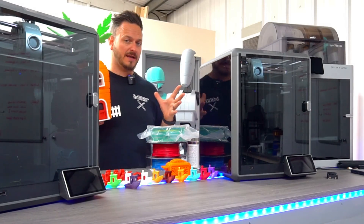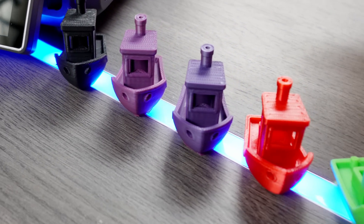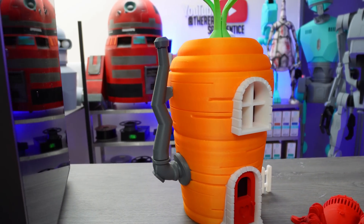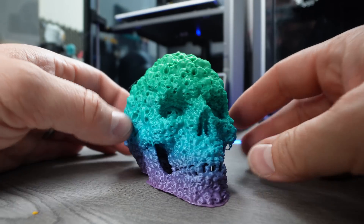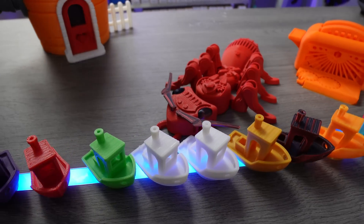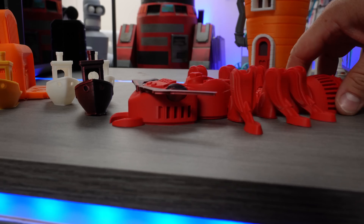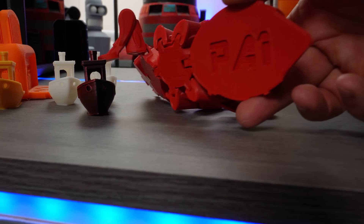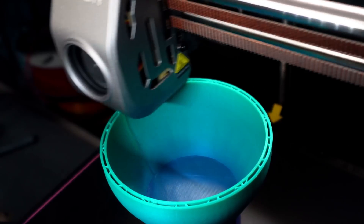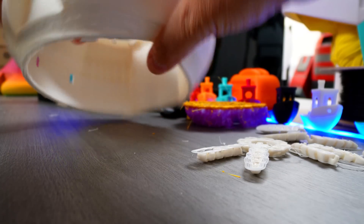So what are the quality of the prints actually like? The K1 has truly exceeded expectations in its flawless printing performance, ever since the parts were changed and the firmware was upgraded. The overall quality of prints and ease of print removal has been exactly as anticipated. The printer has proven its versatility by successfully printing various materials including PLA, PETG, and ABS, as showcased in impressive Benchy prints. It's even handled challenging materials such as carbon fiber-infused PETG and recycled PETG without any issues. From a slicer perspective, the tuning has heavily centred around Creality's ecosystem, and while it performed admirably with Creality's recommended filaments, I encountered some challenges with other filament types requiring additional fine-tuning and experimentation.